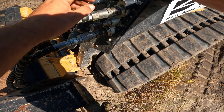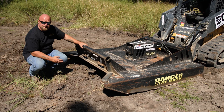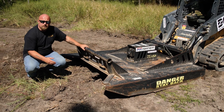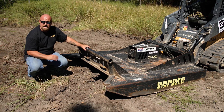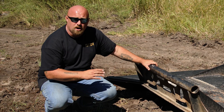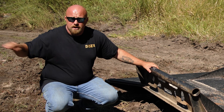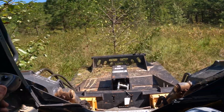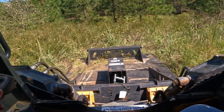This is a six-foot bush hog attachment for a skid steer. This is a very dangerous attachment — you have an open, exposed area with a blade that free spins. Make sure there is nothing in front of you such as people, because it will throw debris outward. Note that this spins at roughly 1,000 to 4,000 RPMs per minute depending on the make and model of the bush hog. Always keep in mind your surroundings. A bush hog can typically take down a one to three inch sapling tree with no issues and is also good for cutting down underbrush such as briars, while keeping you as the operator safe.